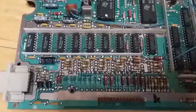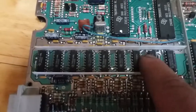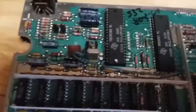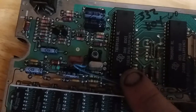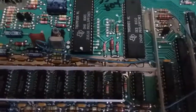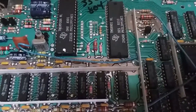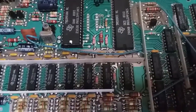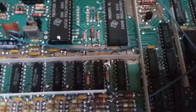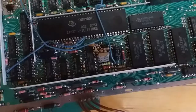Speaking of the memory, there's the 16 kilobytes of RAM, is these 8 chips here, which these 4 are for the main RAM, and these 4 are for the video chip, which is where this computer gets its name. This is the TMS 9918A, which was an upgrade revision of the original 9918, which existed in the original TI 99/4s, which had a lot of graphic problems and lack of bit mode graphics, which really hindered the original model of this to almost have a bad reputation.